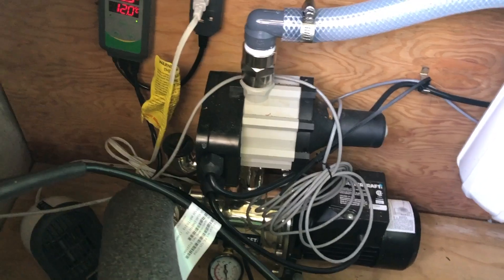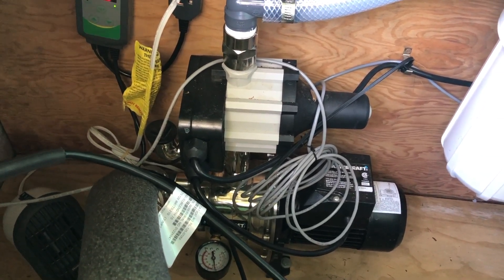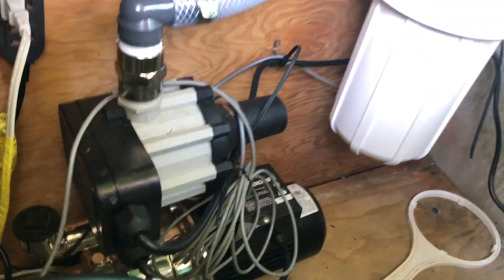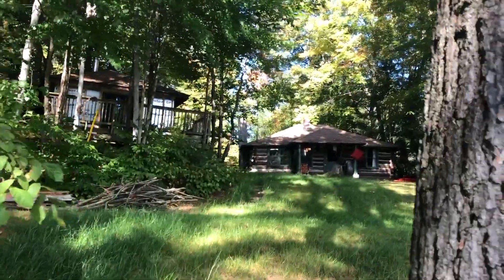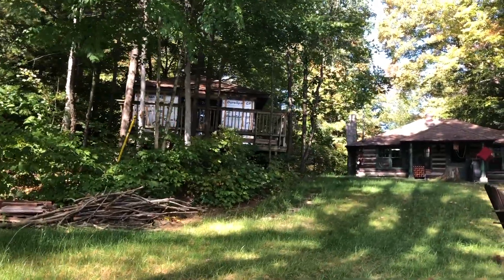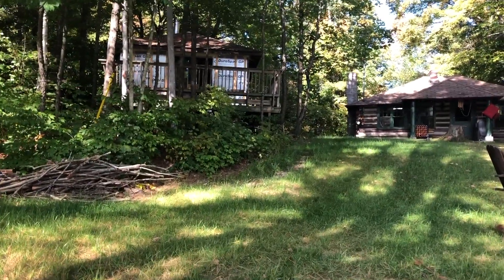The pump is just a cheap jet pump without a diaphragm or an expansion tank. The way it works is that if it senses a pressure drop, this little electronic device switches on the pump. So that's one less thing to freeze if we had an issue with this water system. The water goes all the way up the hill to our new office bunky, six feet underground.